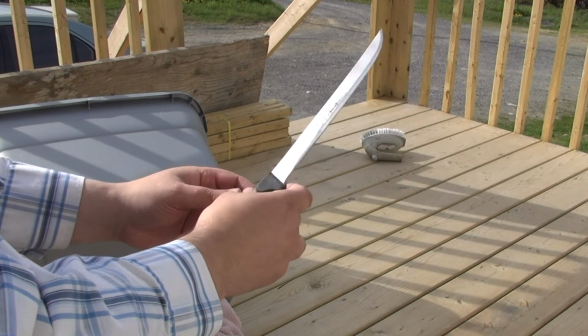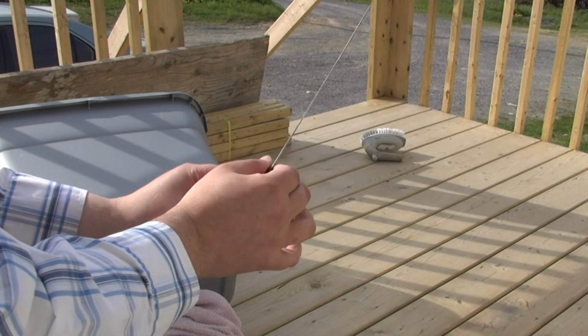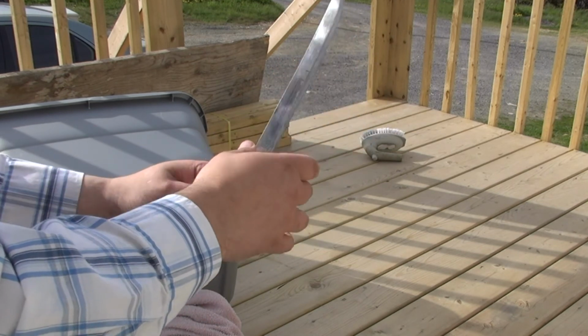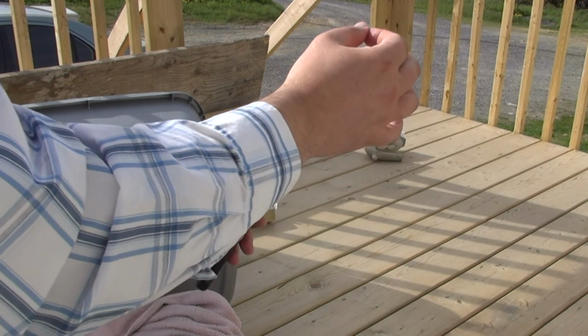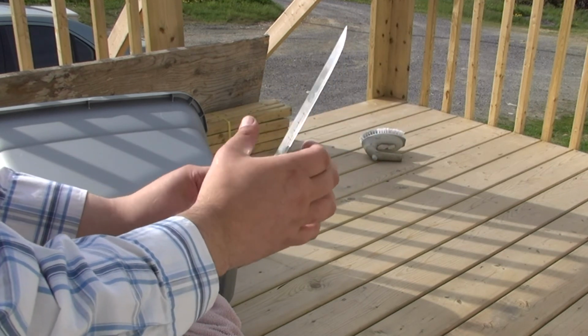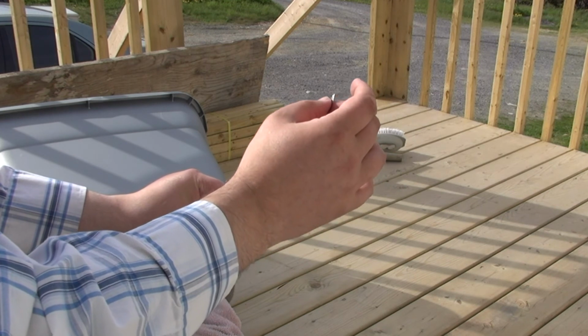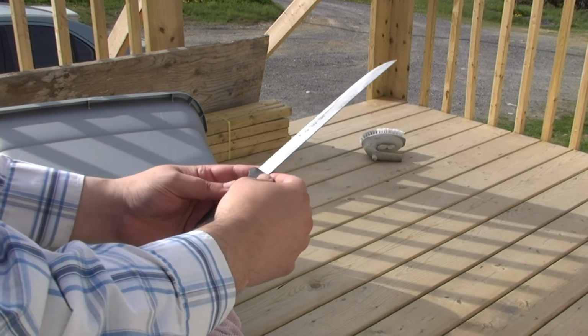I've done a bunch of modifications to this. I've tapered the handle in here to the blade. I've rounded off the end. I've rounded off this here. I've rounded off the spine. I've flattened both sides of the bevel so they're symmetric, and zeroed them right down to the edge. Cleaned up the tip a little bit, made it a bit sharper.